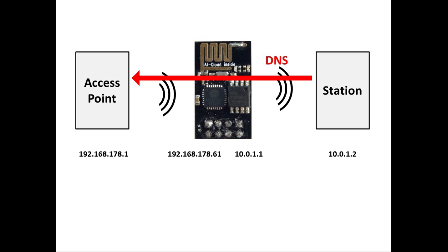What is still required is some access to DNS — the Domain Name System of the internet — for the station behind the ESP. Here we know about a DNS server on the access point, so it is easier to distribute the IP address of that server to all the stations as a DNS responder, so that all DNS requests are passed through the ESP and right to the access point. This is completely transparent to all applications and the network configuration, and it's distributed via DHCP.